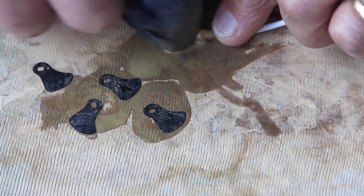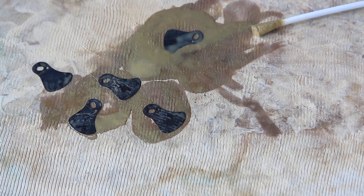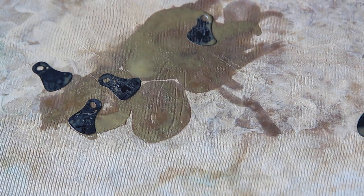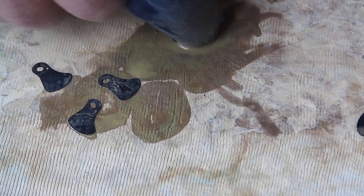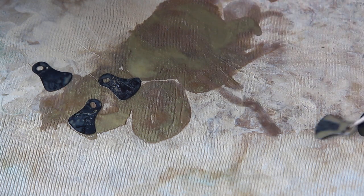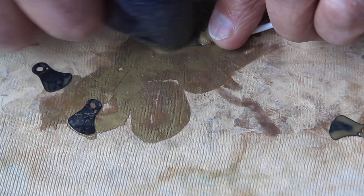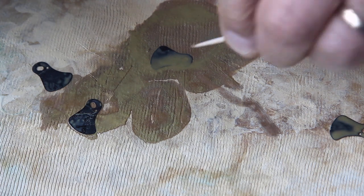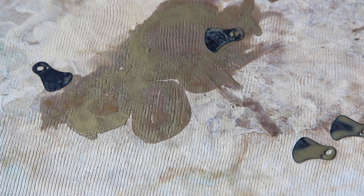And this will polish off all that light surface corrosion that I saw on those blades, and that surface corrosion has the appearance of fine webbing. It's the same sort of pattern you would see with fungus on lenses sometimes. It's like a fine webbing or a veil, often not extending over the whole surface, but it's just corrosion of the surface. And this will also polish off any marks, any stains on there that have resulted from oil being on the blades. Sometimes you get staining from that.